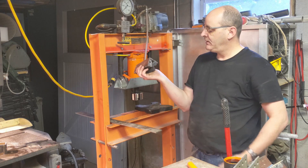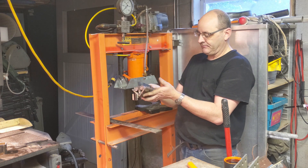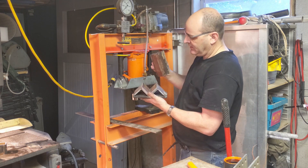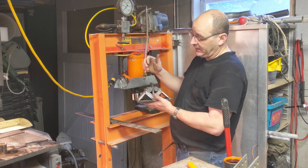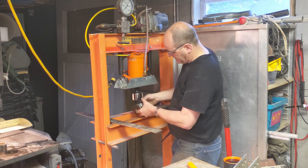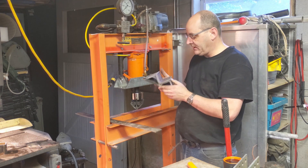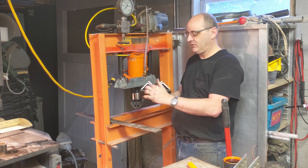Into the 3/8-inch groove we can put this: a 90-degree press brake die. This is the ram part; the other part is the V receiver. I made that — just some heavy angle iron, welded up into a V shape. V'd out the bottom of this V with the bandsaw and with an angle grinder a little bit, because they have that curved webbing in through there.